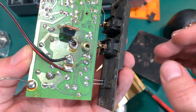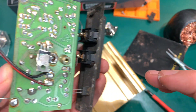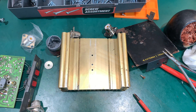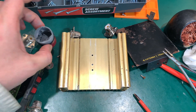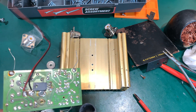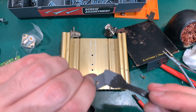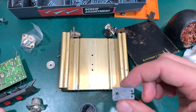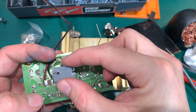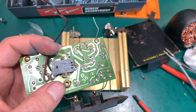Does this board require cleaning? I don't think so — that looks like flux. We are going to clean it up, and I'm going to add a little bit of thermal paste on the transistor, and some on the insulation plate just to get a nice contact. Just like that — I'm going to align that so it nicely sticks into the transistor.